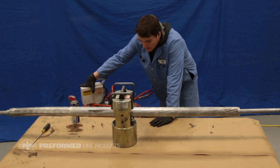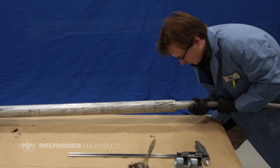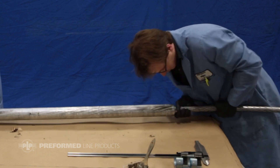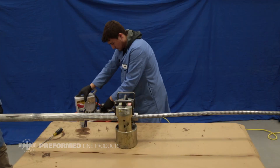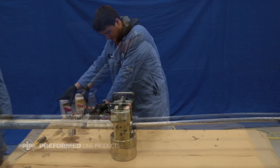Compress the center of the outer tube to the coupling assembly with one crimp. Slide the inner sleeve on side B into the outer tube until one inch of the inner sleeve is sticking out or it is stopped by the indents. Compress side B starting at the inside mark and compressing outward until the end crimp point. Overlap the crimps to ensure complete compression.